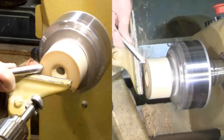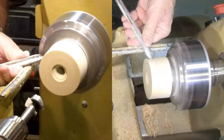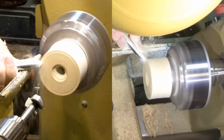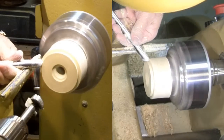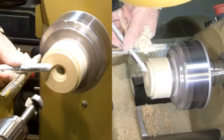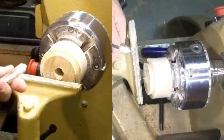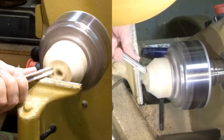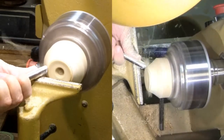I'm using a skew to scrape a short chamfer where the threads begin. This helps the threads easily engage when mounting it to the tailstock. I'm also cleaning up the face of the faceplate — not necessary, but it makes it look fresh and new. I'll trim a little more to make sure the faceplate is still round. I'm making these faceplates interchangeable between the headstock and the tailstock. The threads enable the tailstock mount, and now I need a dovetail tenon on this side so each faceplate is bilingual. On the other set, I glued on another layer of poplar to cover the threaded hole to make a smaller cup for smaller balls.